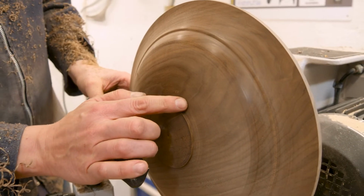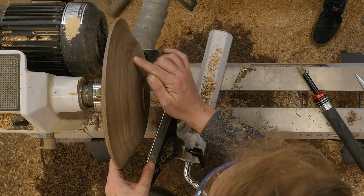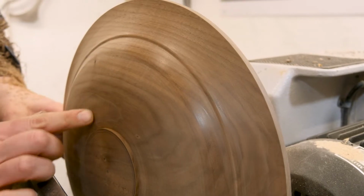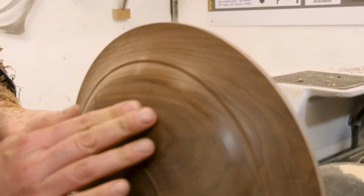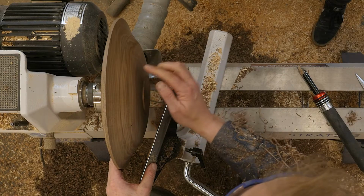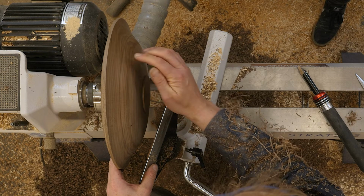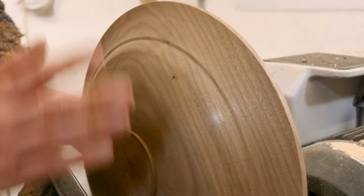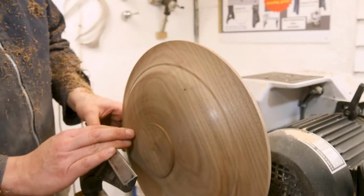Okay, so that is nice and clean, and we've taken away the hardening on the surface from the bevel rubs. There's no tears in the grain, and that would sand very easily. Now I'll just finish this area here, and then we'll perhaps show you with the negative rake tools another way of getting a better finish.